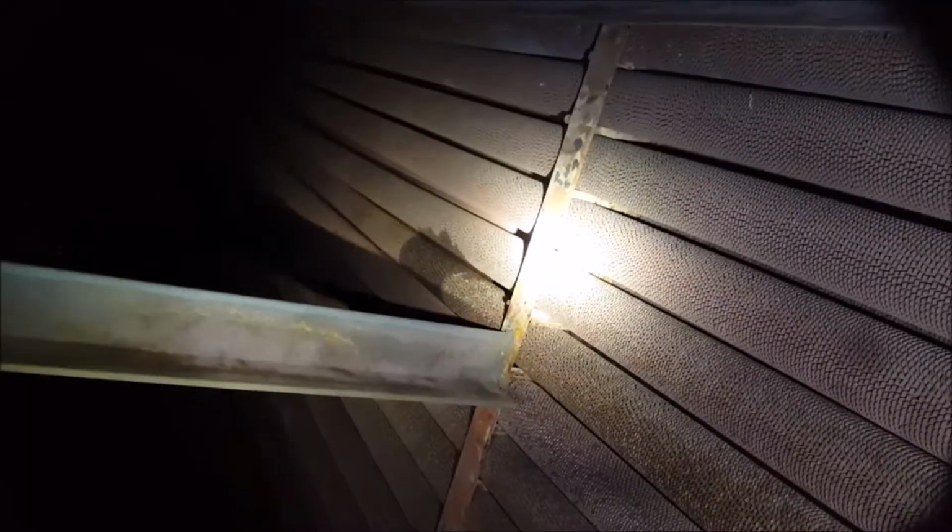We have this going on right here, which is a bowed tube. Could indicate pluggage or overheating of some sort. But I don't see any water coming from the top, like right there, like we suspected. That's right there. If you stand right here, you can see the water bubble and squirt out right there. Right behind that tube, it could be on the back side of that tube.